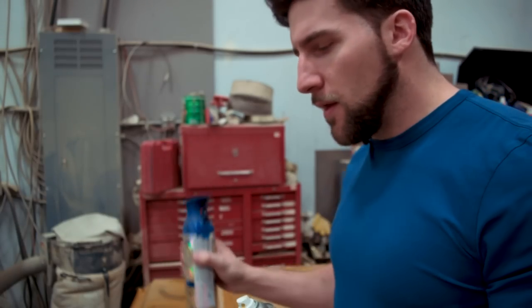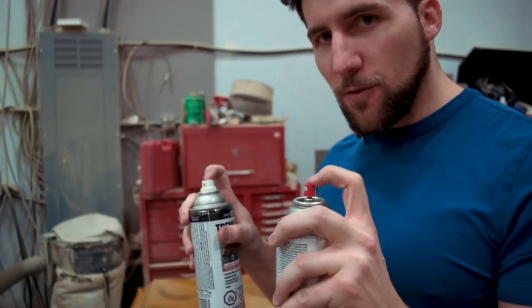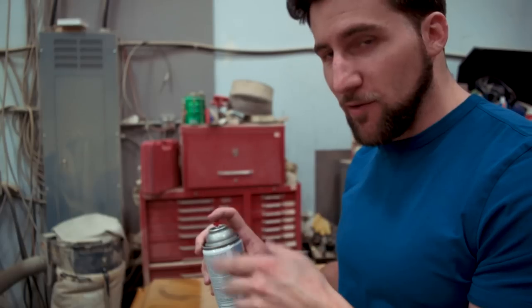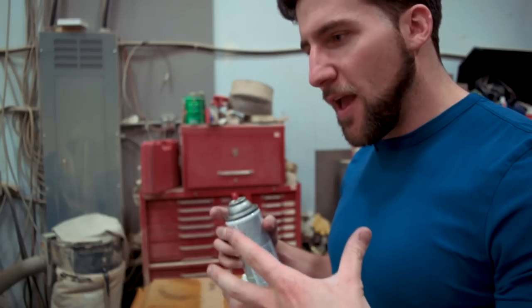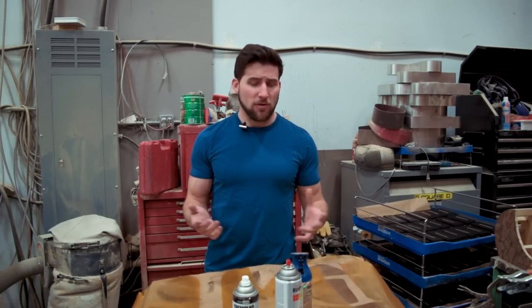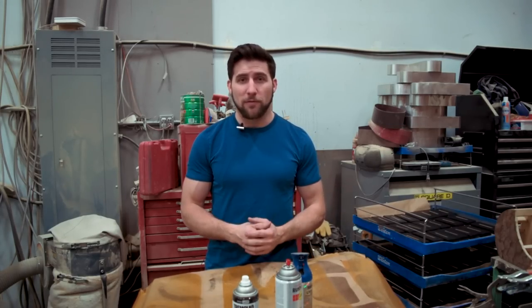I spray with my thumbs sometimes when I'm doing big surfaces and my fingers get tired. What you get is people spray and their fingers get tired and they move them forward so they can leverage against stronger parts of their fingers as opposed to the tips, and their finger curls over the edge and the paint stream hits their finger and then bounces and drops and spits. It's called stippling — the paint stipples because it hits your finger and bounces off at weird angles and comes out in bigger, not properly atomized drops. So keep your finger away from the spray and you will find that actually probably solves the problem. It has for quite a few of my viewers.